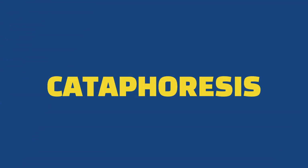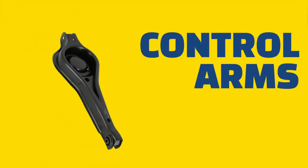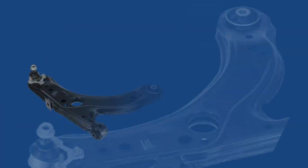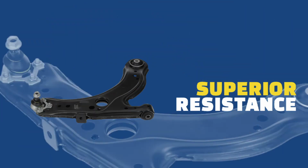Cataphoresis is a surface treatment that consists of electrochemically depositing an epoxy-type coating on a metal part. MOOG applies cataphoresis to sheet metal wishbones, control arms, axial rods and tie rod ends, ensuring superior resistance to corrosion. MOOG's cataphoresis coating significantly outperforms the electrostatic spray painting technology used by many aftermarket suppliers.